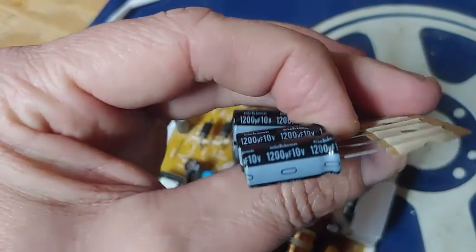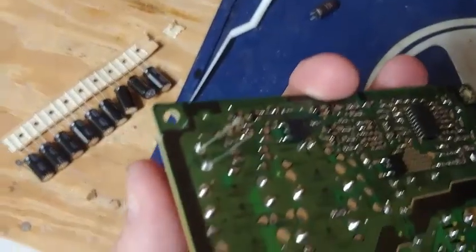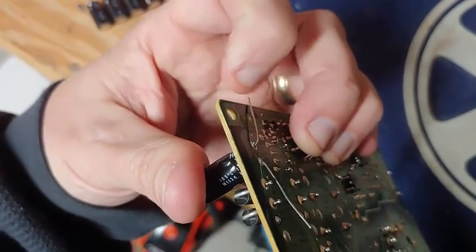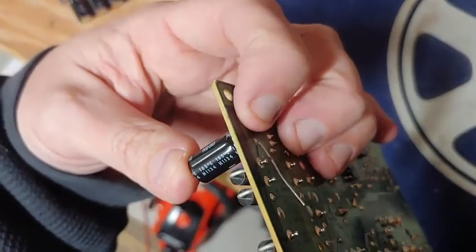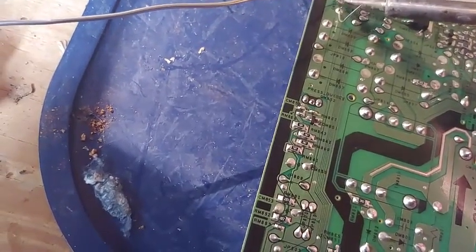I matched up the specifications and I'm putting this back in — the negative side goes here and the positive side to the opposite side. You stick the two leads through the correct polarity holes, then touch solder to it and solder it back up. I've placed the capacitor through with negative on negative and positive on positive. I'm filming this one-handed without a tripod, so bear with me — I'm going to solder this now.